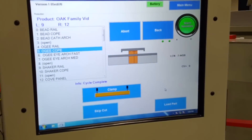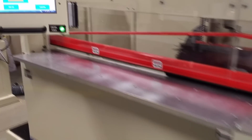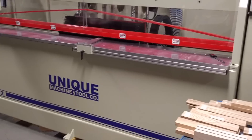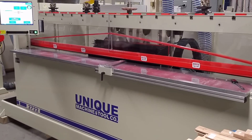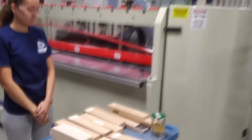It is worth noting that this machine is also capable of dowel drilling and aggregate routing operations such as louver grooving, pocket mortising, and other edge routing applications. The Mitsubishi controls with Unique's interface, coupled with dual 14-horsepower HSK 63F router motors and an 18-position tool changer, make this machine a powerful tool for piece part production or as a complete door remake work cell.